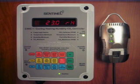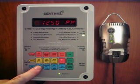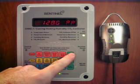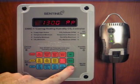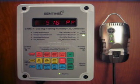For example, to change the CO2 setting, press the CO2 setpoint button. The display shows you the current setting of 1250. Use the up or down buttons to bring it to your new setpoint — 1300. Press enter to accept the change. The unit also records the minimum and maximum reading so that you can see how your growing conditions have been maintained.